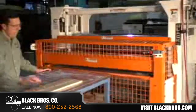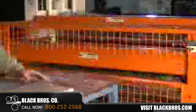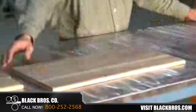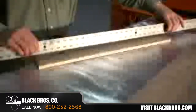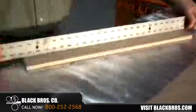The infeed consists of four four-and-a-half inch diameter nip rollers which initially press the flooring together. The piece then goes into a single nip where extreme pressure of the fifteen-and-three-quarter inch diameter roller applies as much as 4,500 pounds per linear inch on a four inch wide plank.